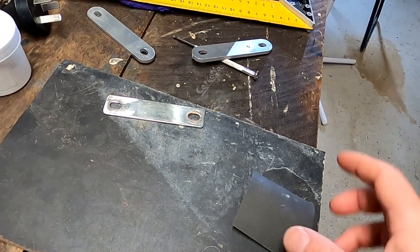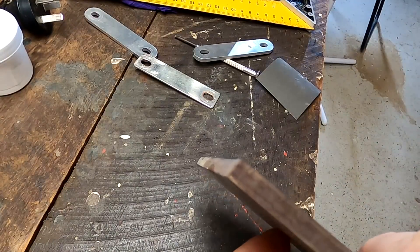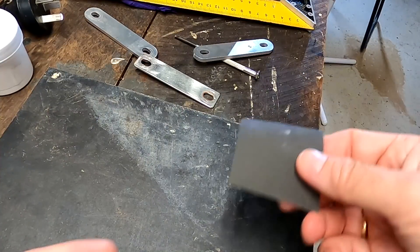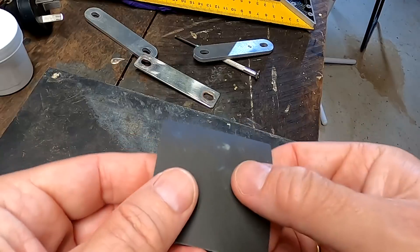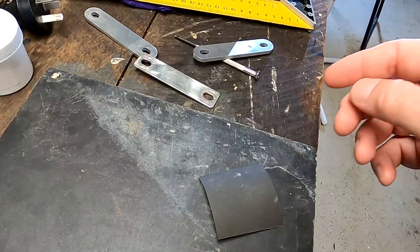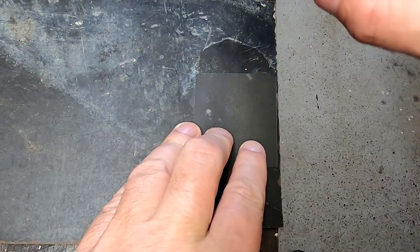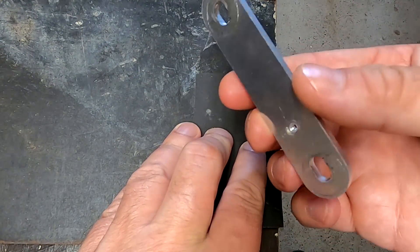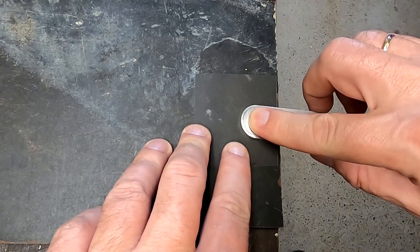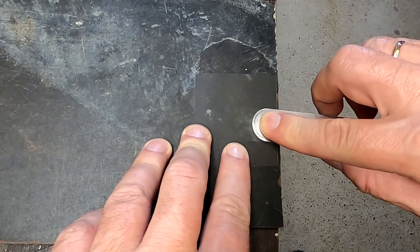So what I have done now: I have this insulation board which is absolutely 100% straight. I put this here on the workbench and I have 800 grit sandpaper - really, really fine sandpaper. I put this on the board and then use the bus bar. This is the one I just showed you. I put this on the sandpaper and just go gently up and down five times.